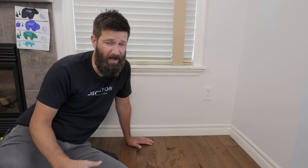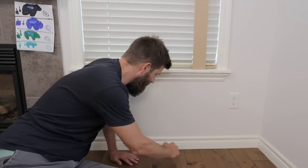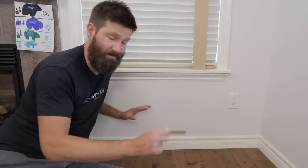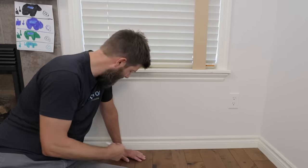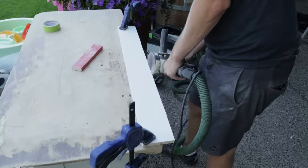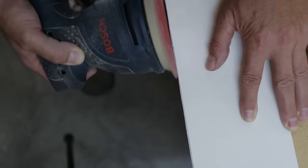This is something I've seen literally hundreds of times at other people's places, and that is giant gaps under the baseboard. The problem often happens with tile floors or even hardwood floors. There are a couple of scenarios when it comes to gaps. The first is when you have a giant hump — that's kind of the easiest situation. All you need to do is level off the baseboard, maybe shim it and get it somewhat level; it doesn't have to be perfect. Then find a shim roughly the same size as the gap under both sides of the baseboard, scribe the middle hump, and trim it down with a belt sander, disc grinder, table saw, block plane, or orbital sander — anything that can do a nice job sanding down to the scribe line.